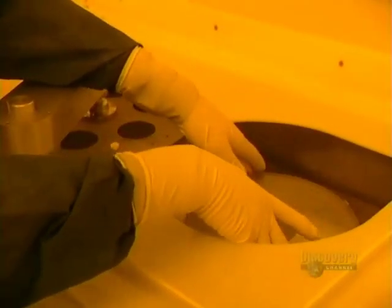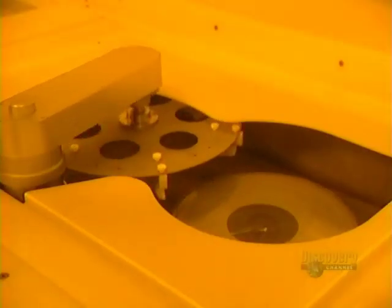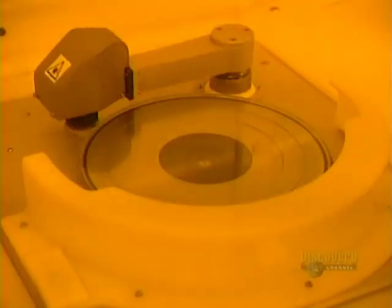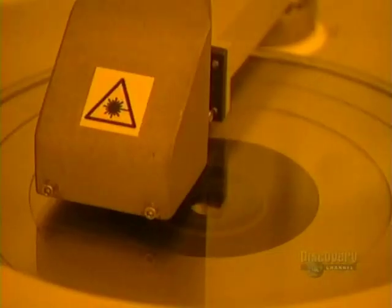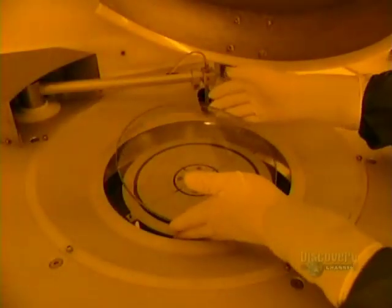Compact discs are copies made from an original glass master disc. A thin plate of glass is first placed in a unit which brushes the surface to perfectly clean it. Cleaning is done with deionized water and a small goat hair brush. The excess water is eliminated by the rapid rotation of the disc. The disc then goes into a surface analyzer where a laser beam inspects the cleanliness of the surface.